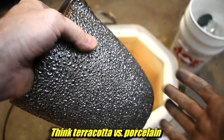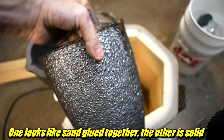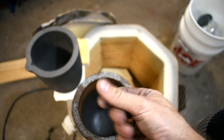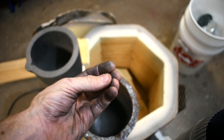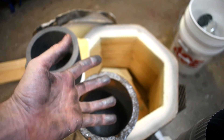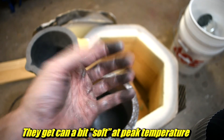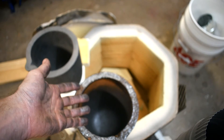Generally with ceramics, the hotter you go, the more fused together those particles get. It makes it stronger, which is nice. But it's not all sunshine and rainbows, because the more fused they get, the hotter they get, the stronger it will ultimately be, but the more it shrinks, so it can deform more. And if you get it too hot, it just straight up melts into a pile on the ground. So there's a limit.